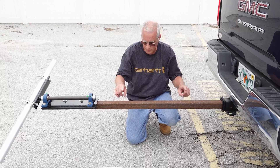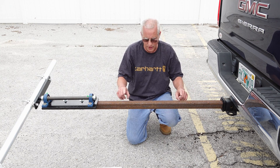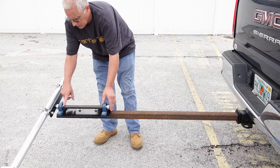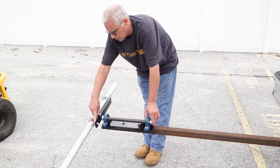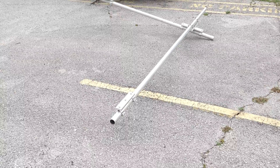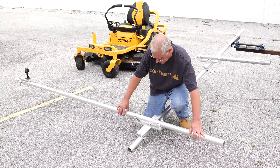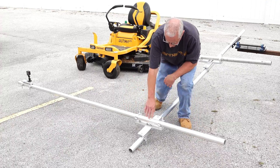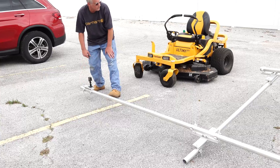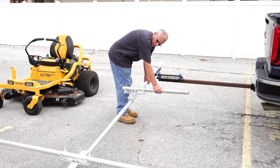In order to have something solid, I used a 2-inch piece of 1/4-inch thick pipe and hooked it right into the trailer hitch. This is a standard hitch receiver pipe, about 4 feet long and bolted to our plate. The plate has a 1-inch rod connected to a 1-inch by 2-inch steel bar and then clamped on to an upright. The upright then goes over to a cross piece. If we balance this cross piece with counterweights over here, this is going to stabilize it a lot more. The further out you go, the more twisting you're going to get. We thought the pipe was twisting, but in fact it's the clamps that are twisting. So we put this bar here to be able to hold and stabilize it a little bit better.